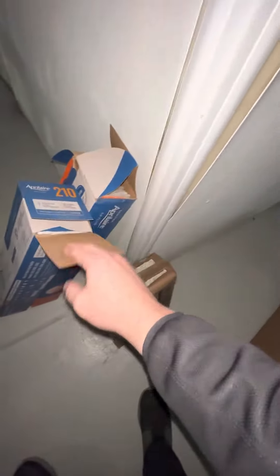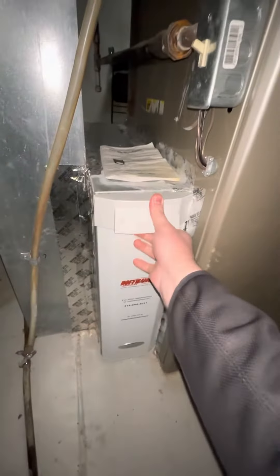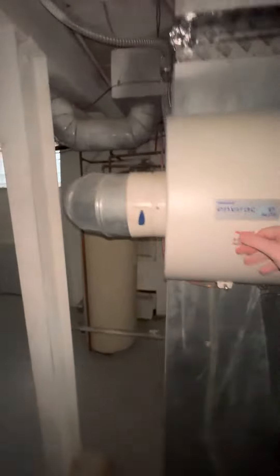Over here looks like we've got a combination of the 213 and the 210. I'll probably just throw on a 210 — MERV 11 — to bring out here, because this one's pretty dirty and it's going to need to be replaced. The other thing we're going to do: there's a floor drain right in front of the unit, and we're going to swap this for a new 600 bypass humidifier. Here's your saddle valve right here that's feeding that.